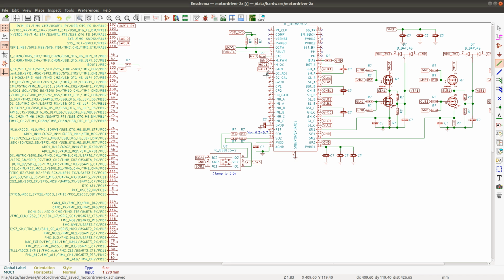I would prefer using a digital potentiometer because the chips that I've been looking at can support saving the resistance values. So essentially, the moment you power on the chip, you don't need to do any other configuration. You're going to have the presets automatically restored. So that's one less thing to worry about. The downside is that it requires an extra chip, unless I have some channels that are free on another digital potentiometer chip that is used elsewhere on the schematic. So therefore, I will just leave this pin unconnected for now.